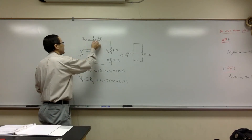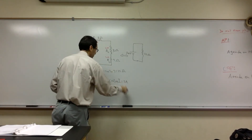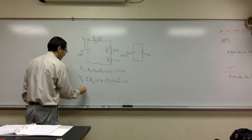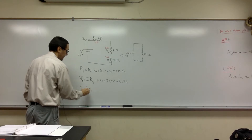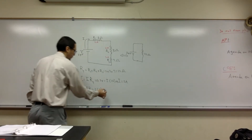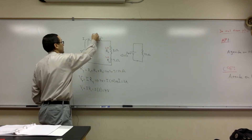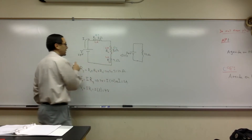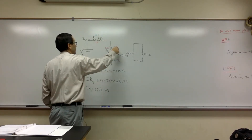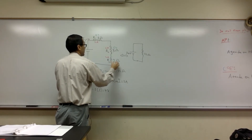So now I have 2 amps going through here, 2 amps here, and 2 amps here. How much of the 24 volts is used up at each resistor? The voltage drop across R1 is I times R1 — that's 2 times 2, so that's 4 volts. The voltage here will be 4 volts, 2 times 3 gives 6 volts. For the last one, you can do 2 times 7, which is 14, or do 4 plus 6 is 10 and take that away from 24, giving 14 volts.